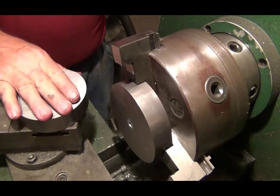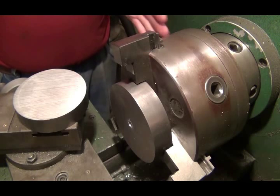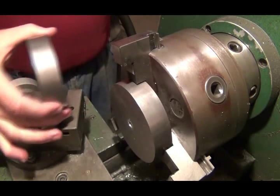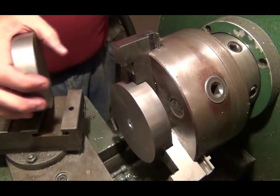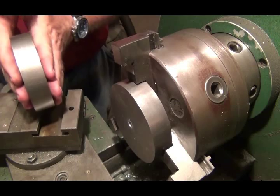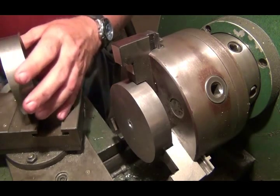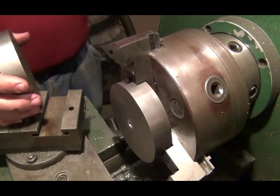The reason I cut them 1 inch, instead of having a 10-inch or 12-inch wide roller, is that if you rolled it and then turned, it would twist the tile. With 10 1-inch pieces, when you twist it, some of them will roll forward and others will roll backwards, or whichever way you roll it, and it won't twist so hard on the tiles.